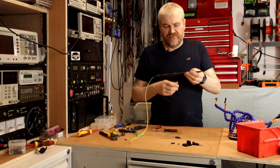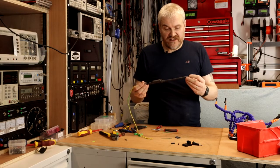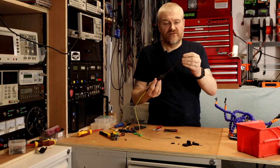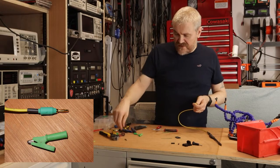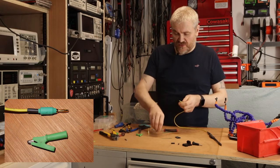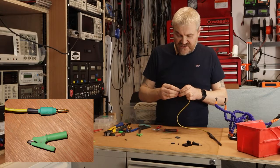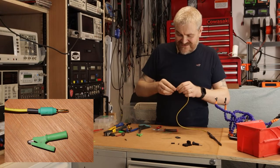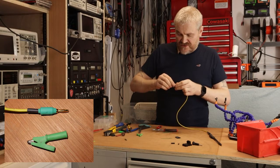So now the resistor is attached to the chopstick, the insulator is completely covered in heat shrink, there is a small tip at the end which is visible, and it then runs neatly into the wire. Different banana plugs attach in different ways so this will vary on the one you've selected, but this particular one is actually for connecting speakers and it simply screws on and grabs the cable.